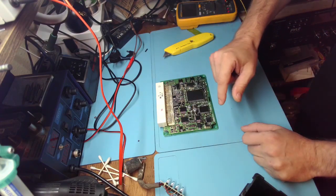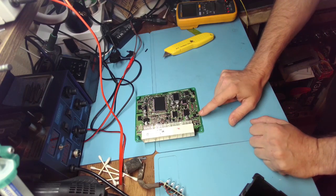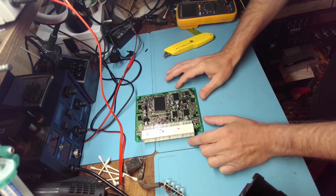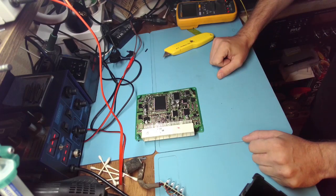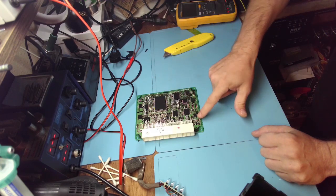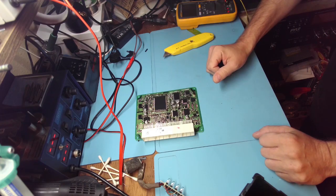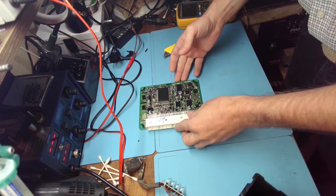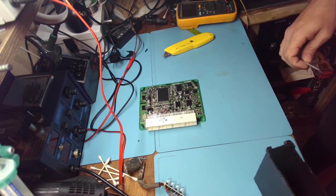If there is any difference in resistance, it's considered faulty and it stops producing signal. It might be considered faulty because of the solder used on these cars in these years — the third generation H6 engines. That solder is just not sufficient when it comes to measuring the output elements or the power stage, and it causes issues. That is at least my latest diagnosis of what exactly is causing the problem.